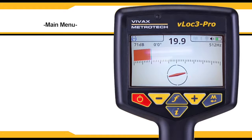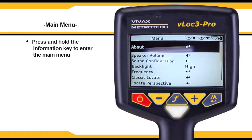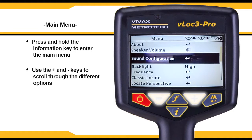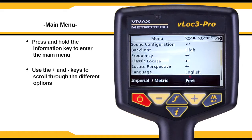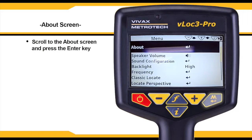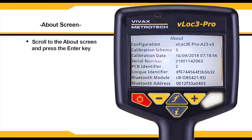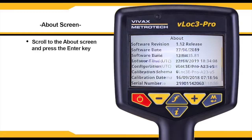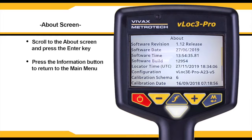To enter the main menu, press and hold the information or I key located underneath the display. Once you've entered the main menu, use the plus and minus keys to scroll through the different options. Scroll to the About screen and press the Enter key. Here you can view different information about the current unit, including the software version and serial number. Press the I button to return to the main menu.